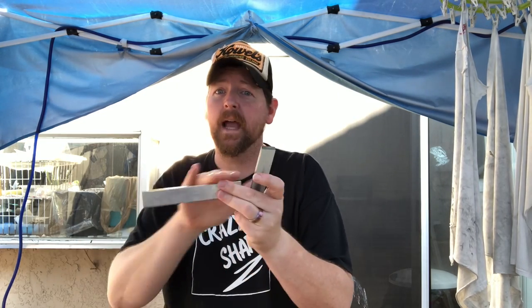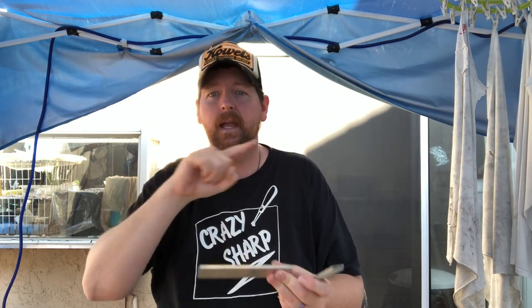I've had to do the same thing with straight razors — they do the same thing. You get a chip and sometimes it's really hard to remove. Sometimes you just have to stand the blade straight up and down to flatten it out. If it's got a smile — when you tip it corner to corner it curves up — you have to remove material off those points. A frown is less of a big deal; you can still sharpen that. But doing it takes off a lot of material from your stones, and then you go back and sharpen. I've had to do that with significant chips.